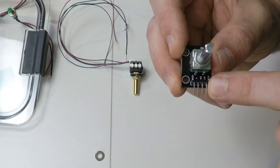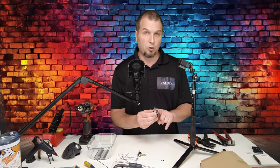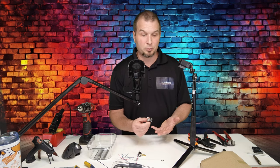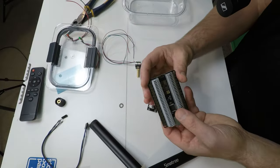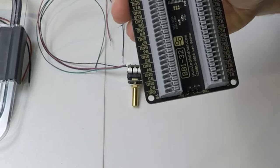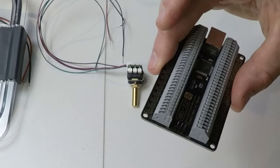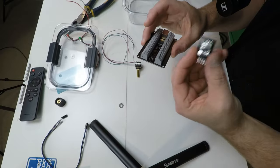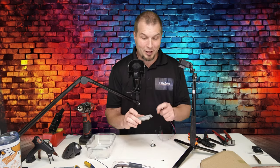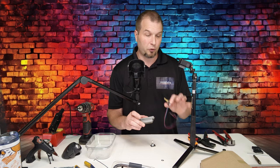The fifth wire that we need to connect to this is a five volt power source. So this board requires its own power source to run. If you're going to use the Amazon encoder, there is going to be one extra step that you're going to need to do to the board. I only chose to show you this, and that's because these are so readily available. If we take a look at this board, on the very bottom of the board here, we have a five volt pin, and we have two ground pins. From Leo Bodnar, these pins are not attached to the board. I had to solder these onto the board myself so that I can connect my five volt power source to the encoder from Amazon. If you're going to be using the encoders from Leo Bodnar, then you do not have to install these pins on the bottom of this board because there is no five volt input on this.